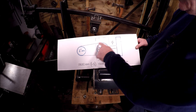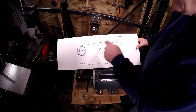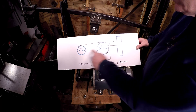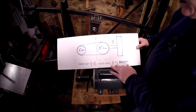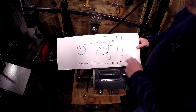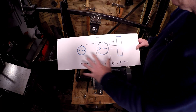So the larger the pulley, the slower the cam will go overall. If I put a two-inch diameter pulley on the input shaft to the gear reducer, there would be no reduction between the two — one divided by one is one — so the input into the gear reducer would be 1800 RPMs, and 1800 divided by 15 would be 120 beats per minute. I hope that makes sense.